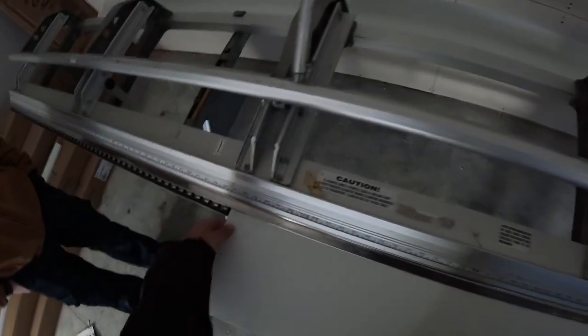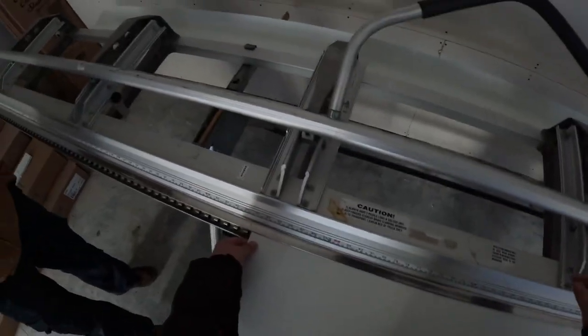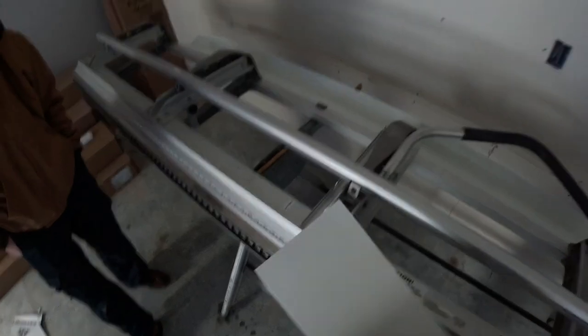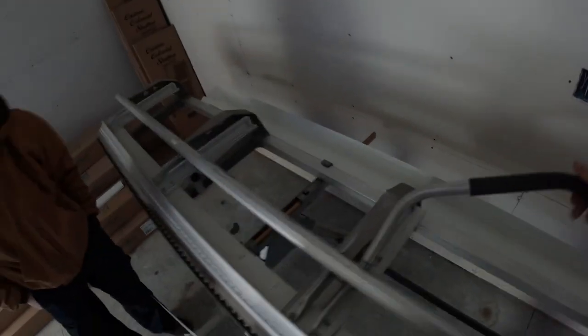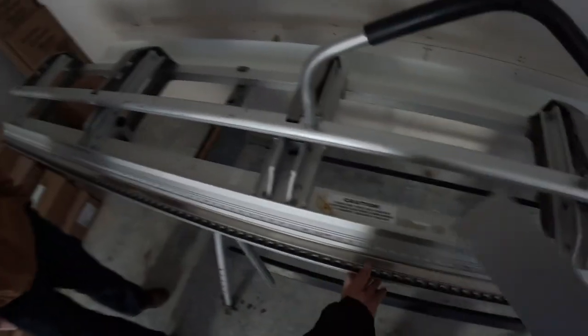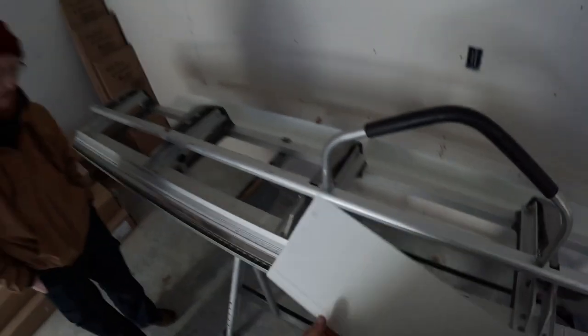Okay, so the first bend we want to do is our 7/8 bend, and this one's the hem. So we have a clean edge. I could just leave a straight edge there and not do this hem. It looks a lot nicer. All the way around. Again, it's been probably 10 years since I've done this, so hopefully I remember. And right there I was just pulling that out so that I can get a tighter bend right there.